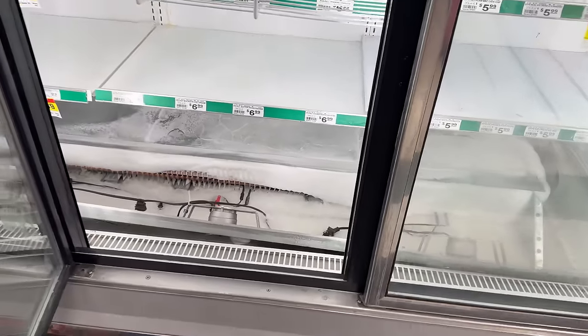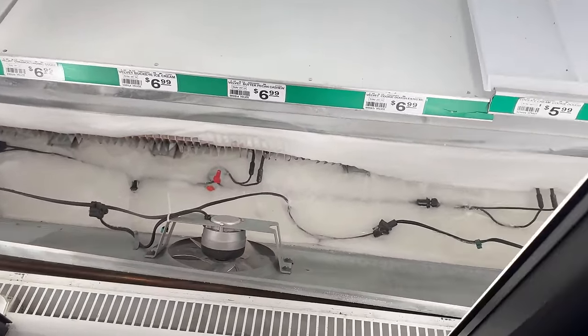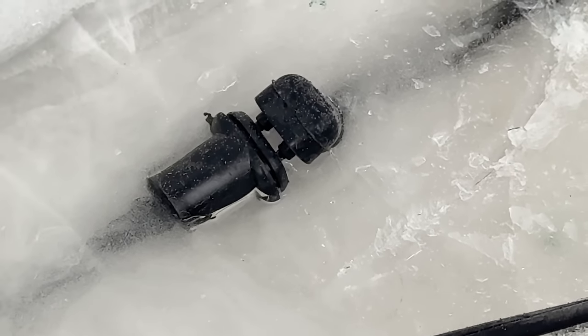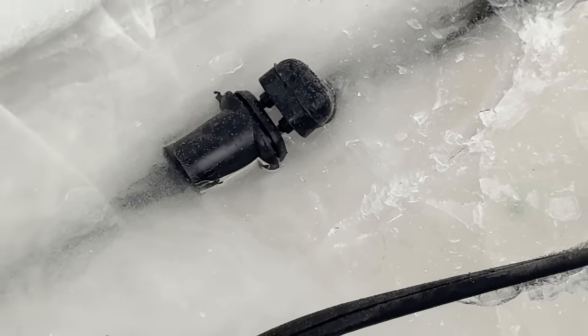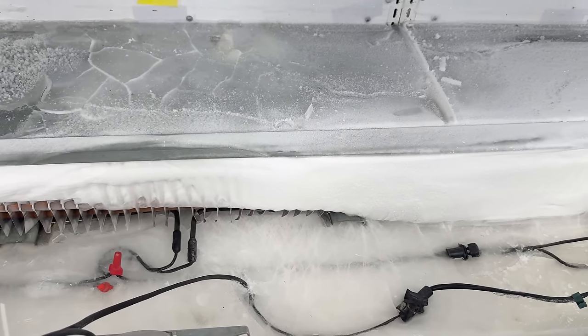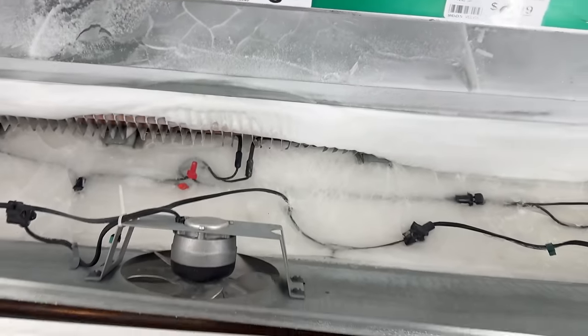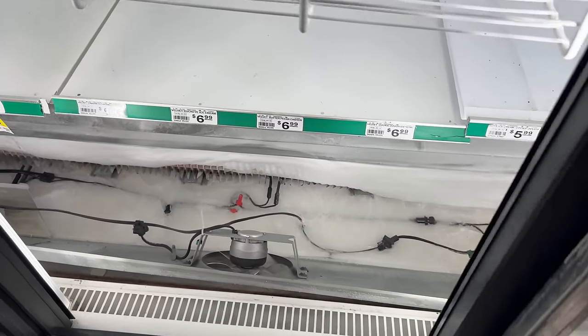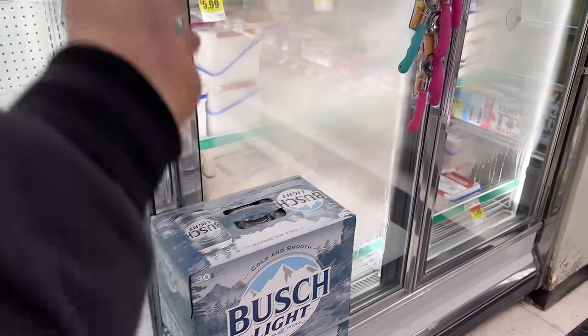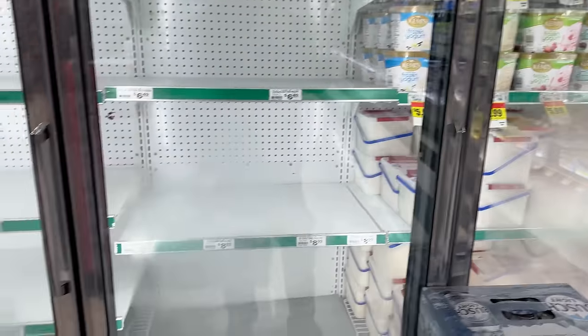These are electric defrost. You can see we've got some issues here. Looks to me like that one there is partially unplugged. We gotta check that with the amp meter yet. Chances are we're gonna have to melt this with water because it'll take forever, and obviously this isn't gonna get it. These cases are all old — most of my stores are really old. Now this case over here was perfectly fine, so they decided not to pull that one.